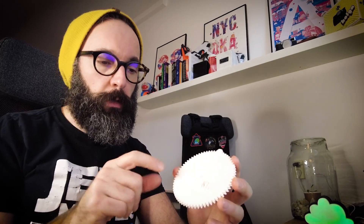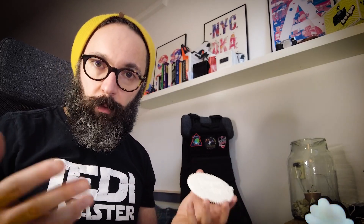There is one more use case for these tools, especially when you have more than one for different diameters of radiuses: if you want to hand-draw the curve of the shape you want to bend, it's very difficult to make the calculations for the number of curves because everything is hand-drawn, so you don't know the angle, the radius, and so on. This tool can help you approximate your hand-drawn curve with real numbers so you can make the calculations easier.